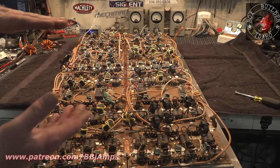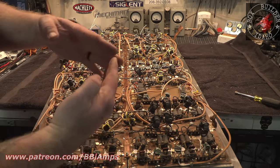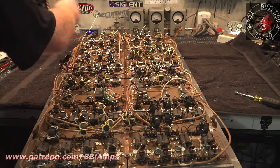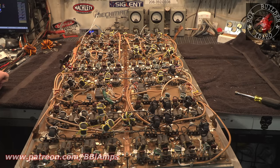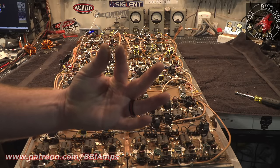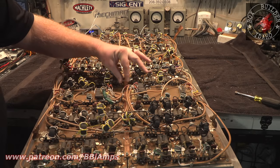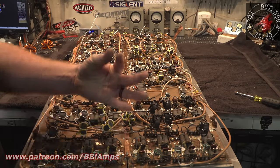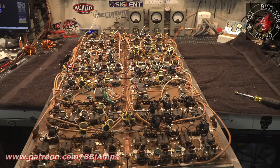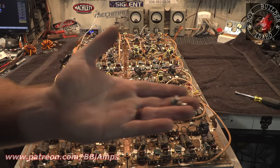With that and then the pressure of us pulling up from the bottom, pulling down from the top, and our sides being locked in, we no longer have any flex in the middle of the cabinet. It can't. So these solder joints will be a lot stronger than, well, I'm not gonna lie, I had to take some straps off. This is what they considered to be a good ground that went between the two boards. So they'd have one here and another one here, another one here and another one here. That's the only thing that was reinforcing. It was like four or five little hunks of 14 gauge wire. And then they'd bury it in a shitty solder blob like this here.